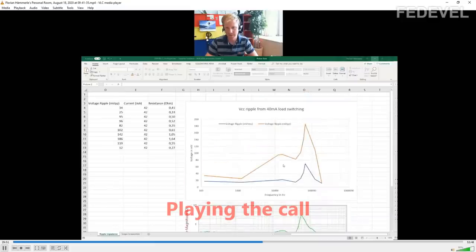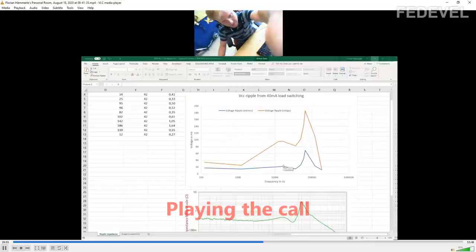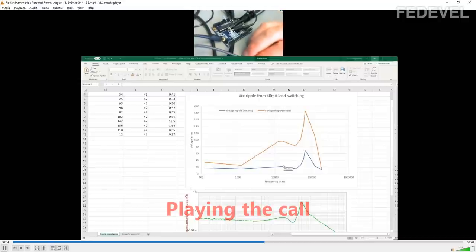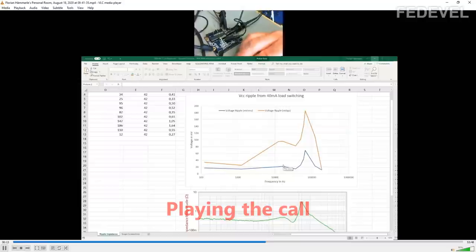So what I did then is adding some resistors to the output pins and to ground. Looks like that. Mm-hmm. So there are the 5 load resistors, 270 ohms, and that will be roughly 8 milliamps, so roughly 40 milliamps in total.